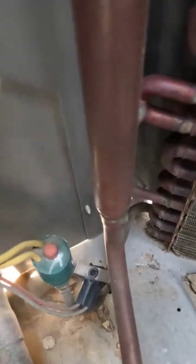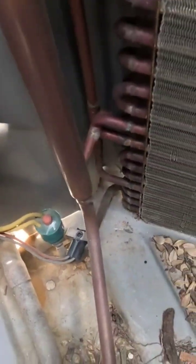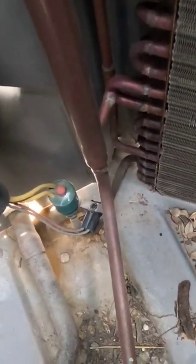There's a button down here in the bottom of this unit to reset it, because this is a high pressure switch. You're going to want to push that button after you replace your motor and it will start working — that button right down there. What happens is that high pressure switch will actually turn off the low voltage to this unit, so if your fan does stop working, it will protect your compressor down here. That's how you restart your unit if your fan stops.